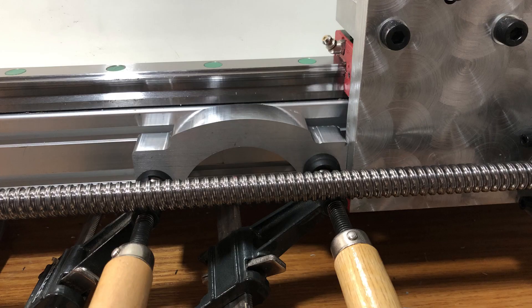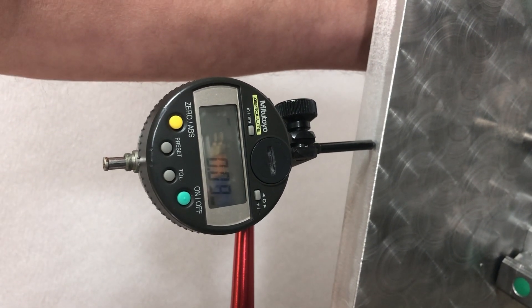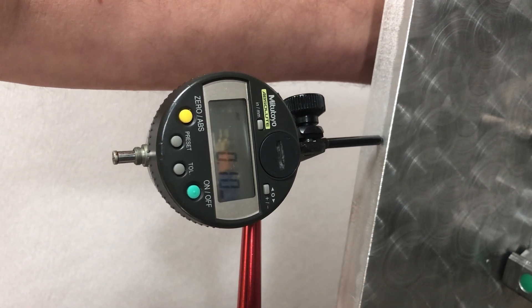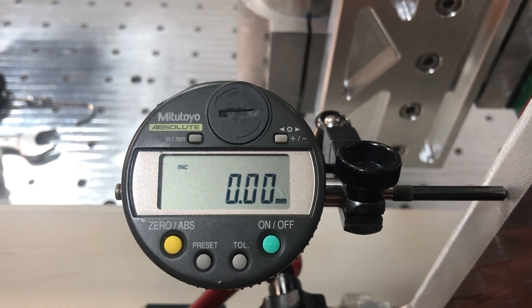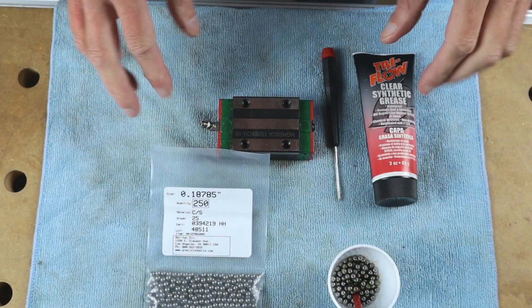If you have seen my last video, I mentioned that the whole gantry tips forward. To eliminate the play in the fixed bearing and the ball screw, I set up a stop block at the bottom of the Y axis. On the left side I can measure up to about one tenth of a millimeter of movement. In comparison, after reballing the right-hand side, we are seeing roughly two hundredths of a millimeter play remaining.